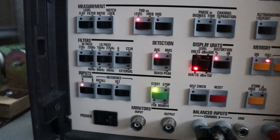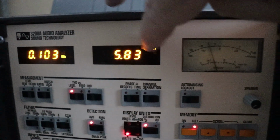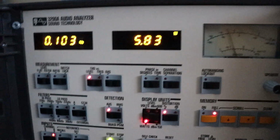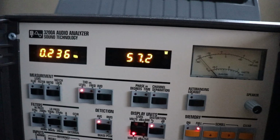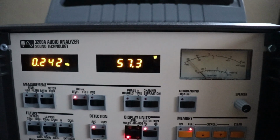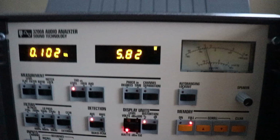We had the left channel down here. I'm going to just hit the B channel down here, which corresponds actually to the right channel up here. So now we're over here. We've got our right channel at 5 watts a channel, about at 0.1. So now what are we going to do? You said it. We're going to run up the right channel now. All right, where are we at now? About 57. That's good enough. Once again, the right channel is running at 0.2% distortion at 57 watts continuous, which is just under its rated 60. Why push it any more?